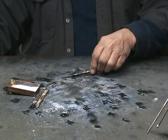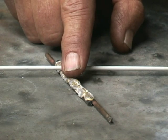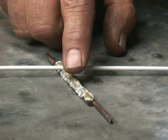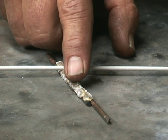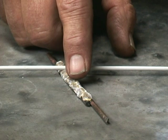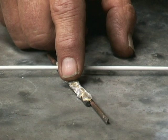One of the reasons for this is this piece right here. I brazed it and left the flux on — didn't clean it off. Now once I finish with most of my pieces, I spray them with a clear lacquer, a clear protective coating. If there's any flux left on, the flux will leave kind of a glassy surface, so I make sure all the flux is off. But in this case I left it on, then sprayed it with a clear lacquer. And you can see these little white dots — almost looks like powdered sugar. In a few days after spraying, that flux beneath the clear lacquer crystallizes and it will just pop up through. You can imagine, with all this flux all over the place, how bad that looks.